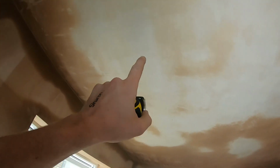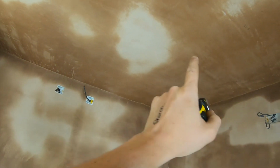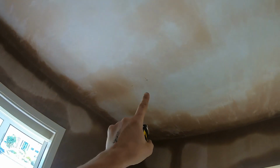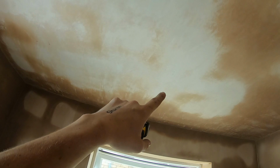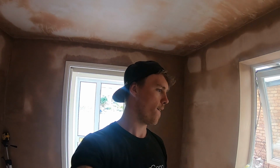Right, I have measured my pencil marks out, so we've gone 700 out. That's 650, that one down there 700, we've got 700 square, 700 square, 700, 640, 700, 640, and then obviously the measurement from that one to that one, centre, was 155, half of that is 77.5. This is without me going in the loft and double checking if there's a beam there or anywhere. The joists run that way. So obviously if we're missing one, we can just rod them, which would be nice.